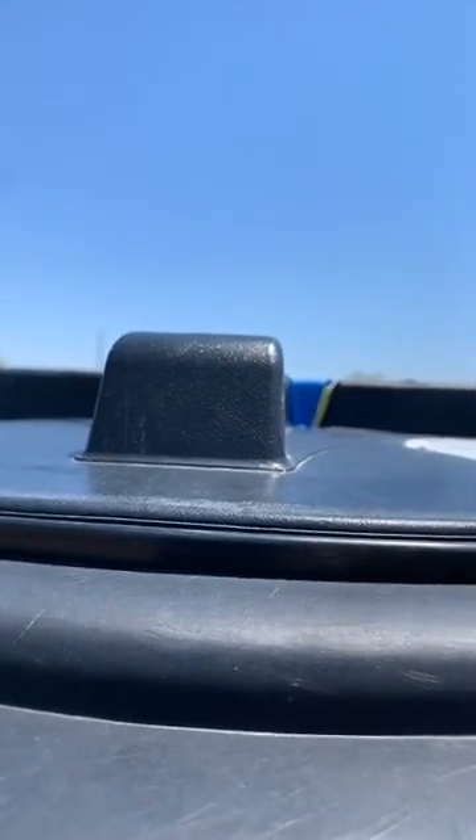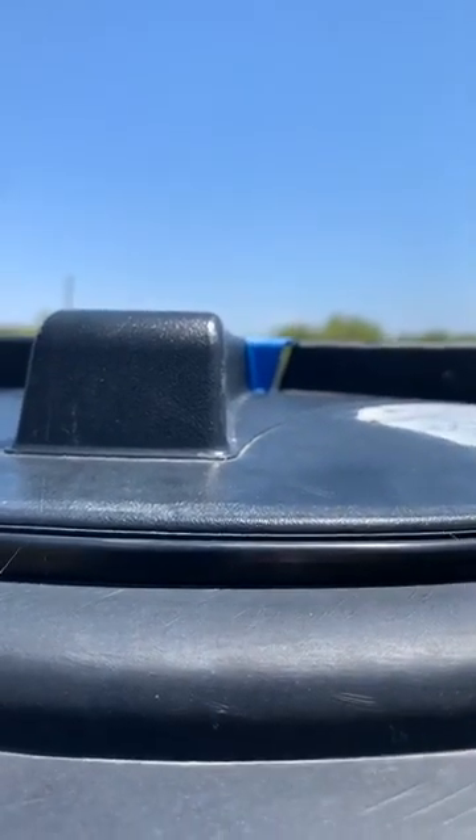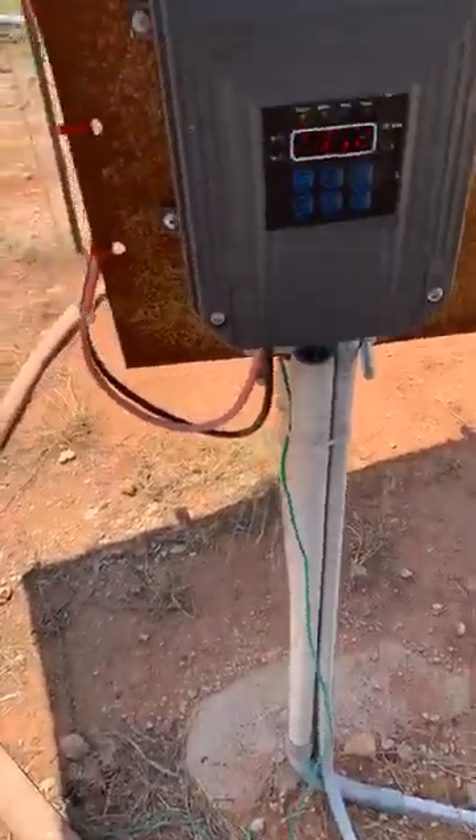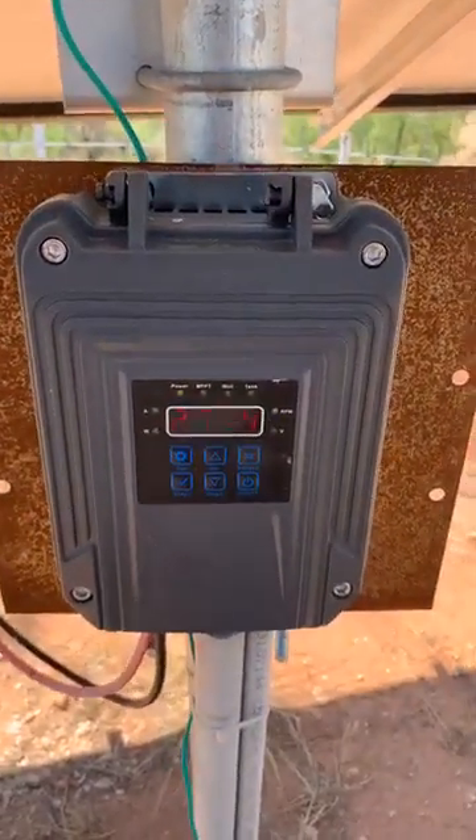Flowing good. It's a very simple installation. You can watch the controller here — 2,700 RPMs. It will slow down a little bit because of the weight of the column of water. When it first turns on you get max speed, but as pressure builds up in the pipe it slows down.